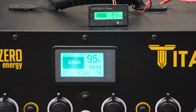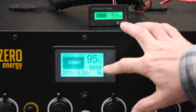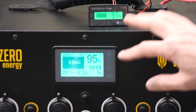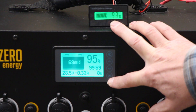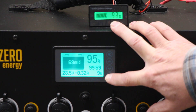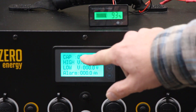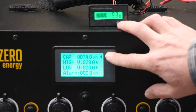There are a couple of things you need to do for this to work accurately. The first is the meter has to be programmed to the size of your battery — how many amp hours it is. One Titan battery is 74 amp hours. The Titan will normally come programmed for that. To program it, you just push the OK button for a couple seconds and you can check the settings. It's at 74 amp hours, so it's good.